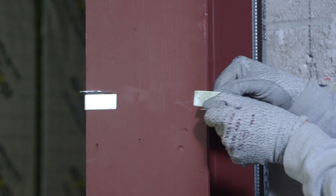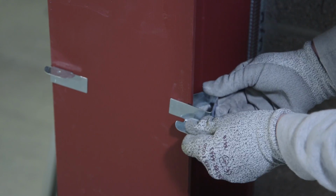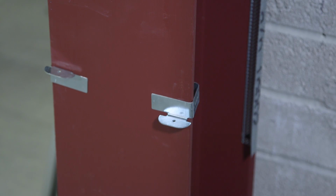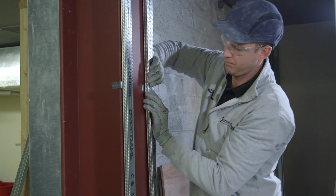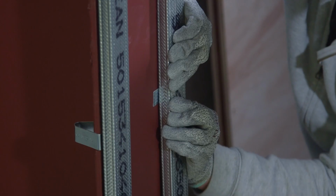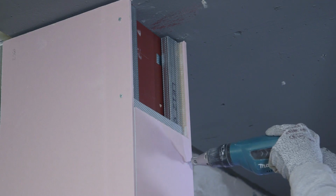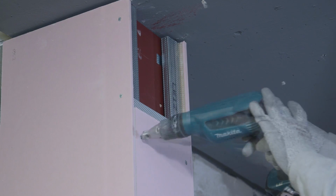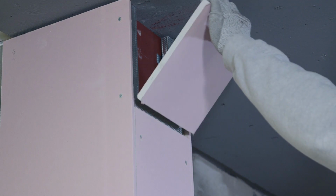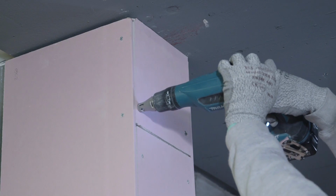The principle for GL1 section joints and at the end of sections at floors or soffit level are the same as four-sided encasements covered earlier. Clip the Gypframe GL1 sections into place. Now we're ready to cut the gyproc fireline boards to size and screw fix them into position with 25mm drywall screws at 300mm centers. Where the column length exceeds the board length, joints should be staggered when cladding the column with gyproc plasterboards.